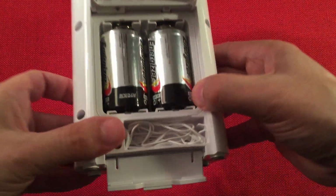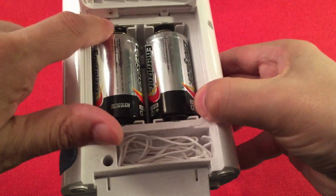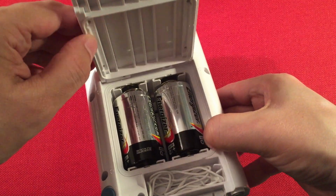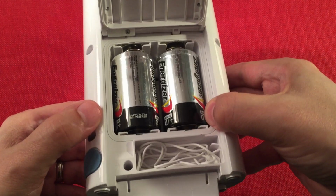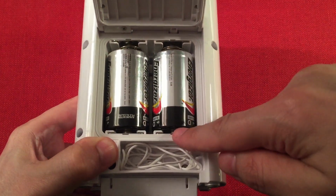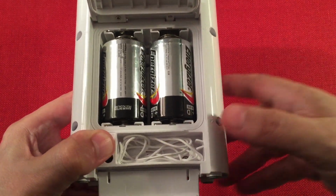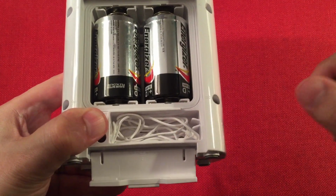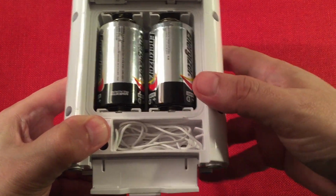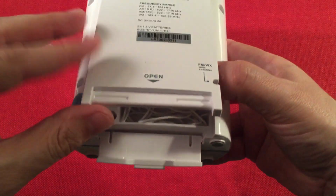So if you look here, there's a gasket that runs around the D-cell compartment bay, and there's this edged area of the door that pushes into the gasket to make it watertight. It's pretty neat. Both D-cell batteries are pointed down for their positive connections. If you look, positive is pointing down for both D cells. The antenna I'm just going to leave in there since we're not going to do an FM band scan, but that is a 36-inch antenna. So we'll go ahead and close this up.